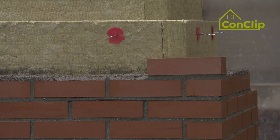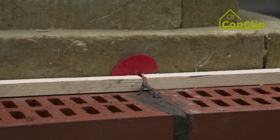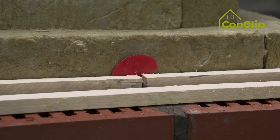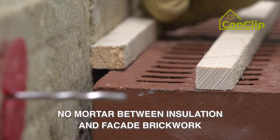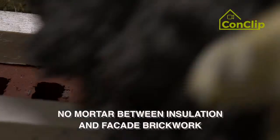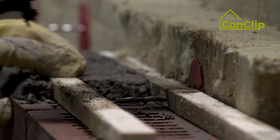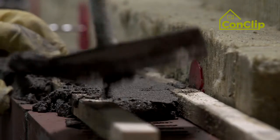After the insulation, the exposed brickwork is assembled. A wooden plate over the joint helps to keep mortar out of the airspace, and also over the sides. Because of the connection to the supporting wall, the anchor in the bed joints has to be grouted well.